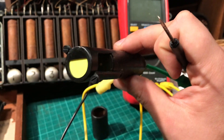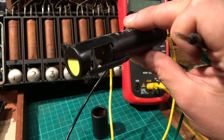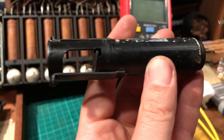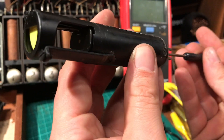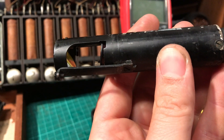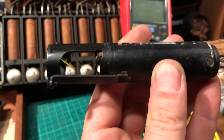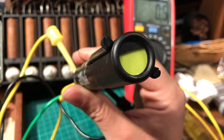This one here is switching on fine, but when you turn the power off it's not returning to its usual position. I found there's a little screw around the back here and if you screw that in, it moves the spring that we talked about earlier further towards the armature and exerts more force on it. You can see it lifting up the flap. So now if we turn it on - there we are, working perfect.